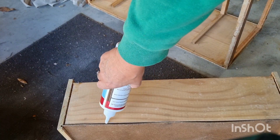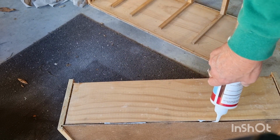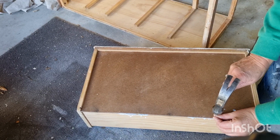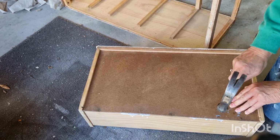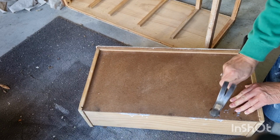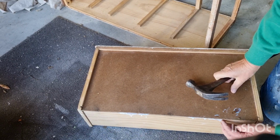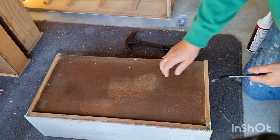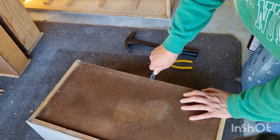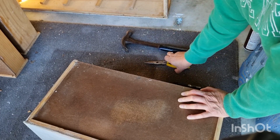So the bottom of the drawers were quite warped. So I just added a little bit of glue in there and some more nails on most of the drawers. This one here, it had a big bow in it, and the bottom of it was scraping along the drawers when you're pulling it in and out. So what I decided to do is just remove it and then flip it up the other way,